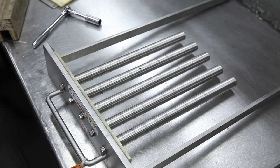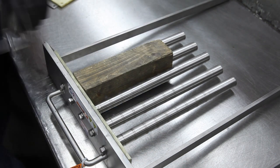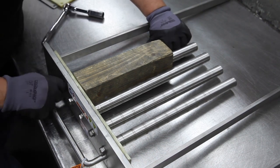You're going to want to keep about one foot of space between these magnets. Now we're going to do the magnetic tube swap. Start with the bottom carriage from the manual unit — it's got fewer tubes. Using the tube guard provided, place the guard on the second tube from the left end of the carriage and carefully remove the bolt from the first tube while holding it apart with the other hand.